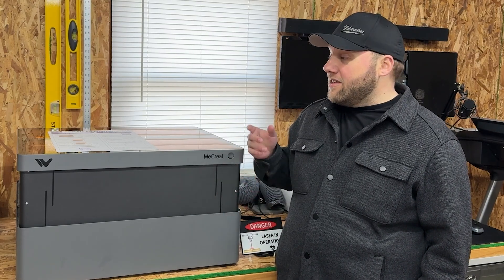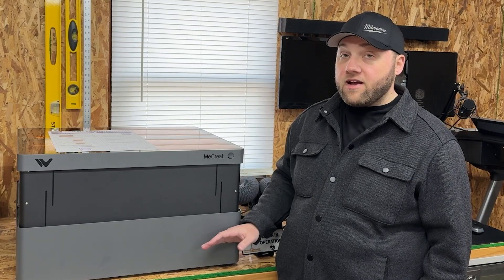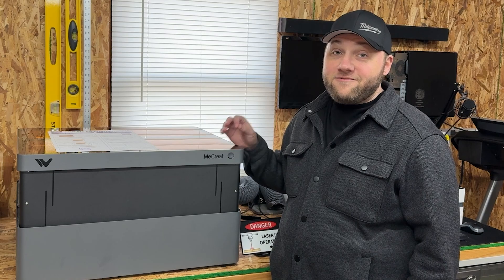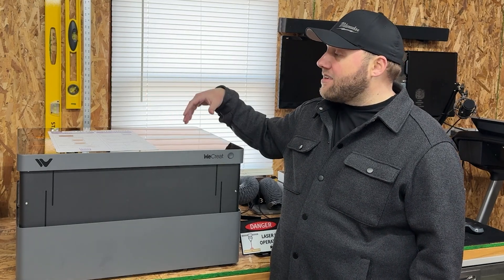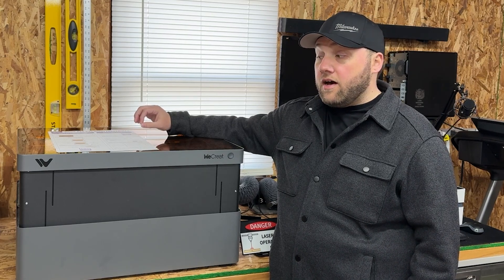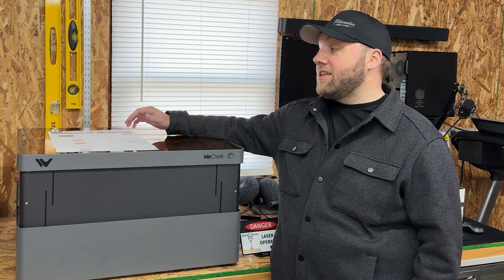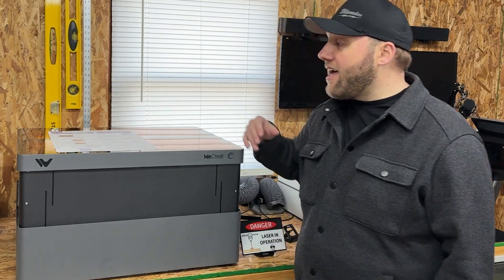The fact that you don't have to remove the honeycomb bed tray every time you want to use that riser base, and you just push autofocus — it automatically lowers and raises — is a really convenient feature. Getting that 45 watts capable of 60 watts for your first laser engraver is going to be an awesome option. The only case where I don't suggest this as your first laser is if you want to do clear acrylic. A diode laser still won't cut clear or translucent acrylic no matter how strong — the wavelength just isn't right. You will need a CO2 machine for that.